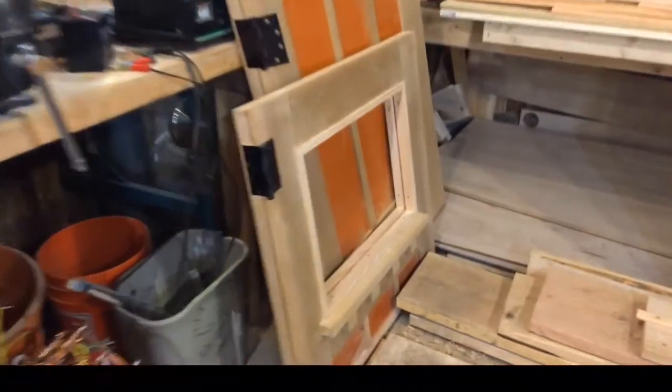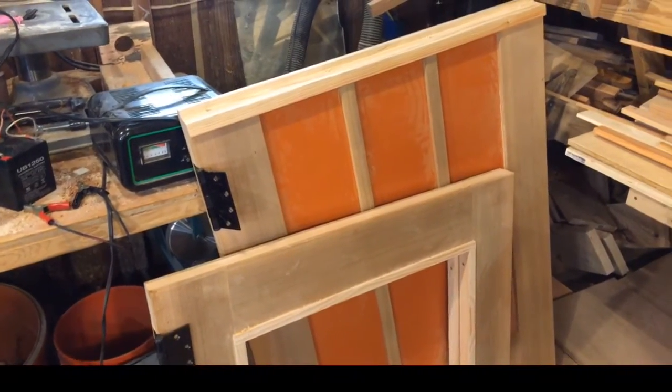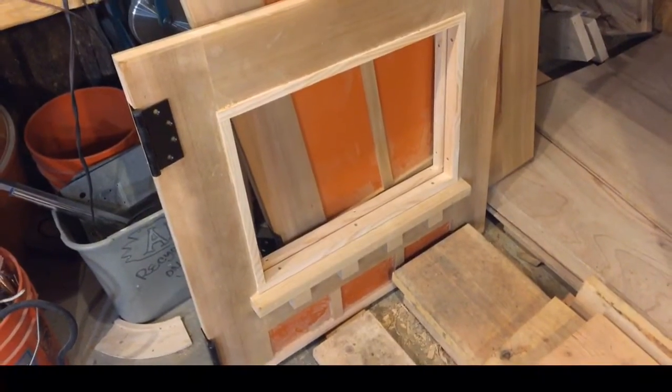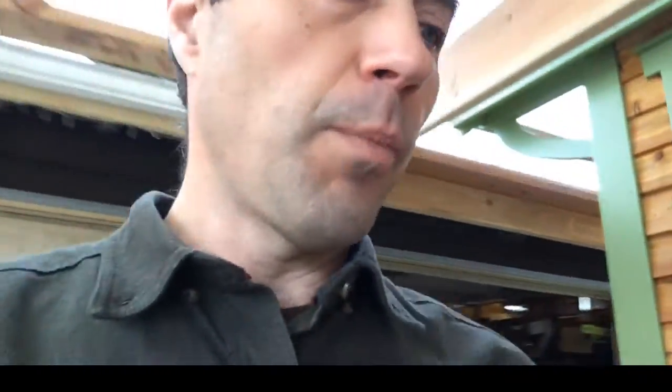Actually, I'm going to show you this door. It's a Dutch door. We are waiting to hang a glass in it. There's a stained glass window for it. A Dutch door is where a door is basically cut down the middle, and you latch the top to the bottom half with a special little bolt latch. Dutch doors are a little complicated — you have to overdo the hinges. Everybody loves these kind of fancy doors, but they add a bit of time and trouble. I don't advise making one if you haven't made a door before. But here's the Dutch door — there's extra hinge, of course.